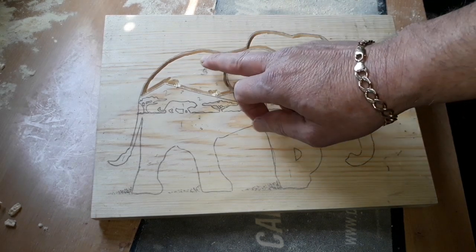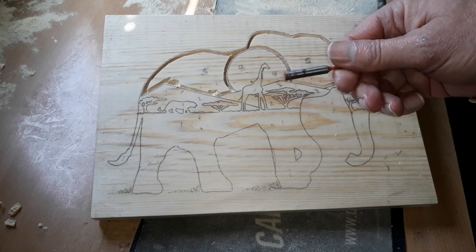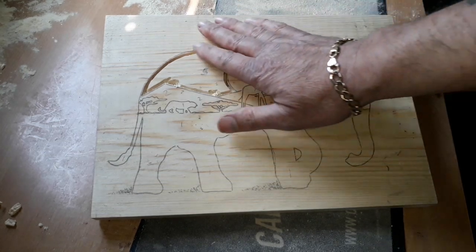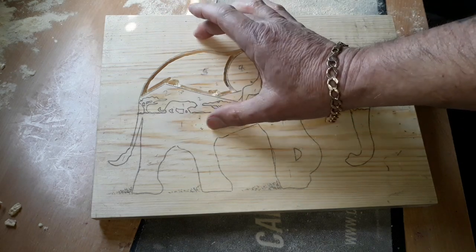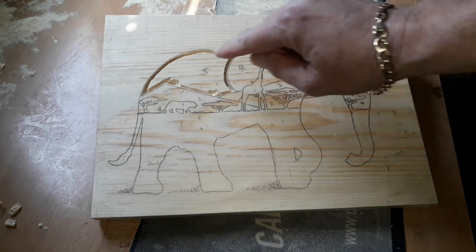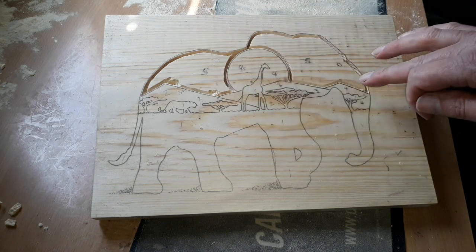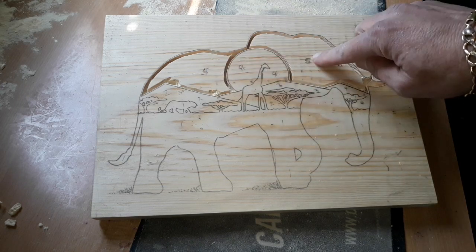We've gone around the deepest part, which is our number five for now. What I'll do next is put on a quarter-inch, one-eighth bit and just remove these two sides. You can actually leave those there to give a bit more base for the router, but it's quite a small piece so it'll straddle either side of that gap no problem. Then we'll come up to number four and do all the fours — that one and that one — and then come up to number three, and so on. I'll remove these two sides for now.